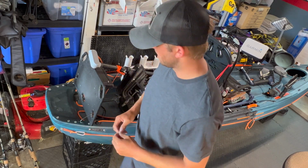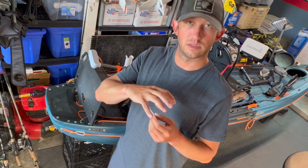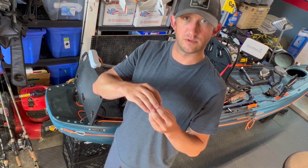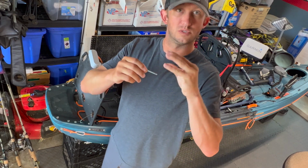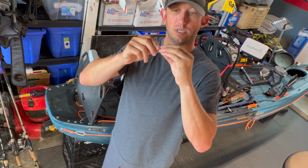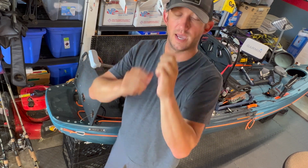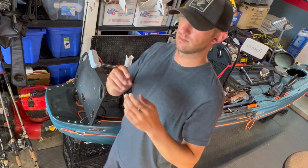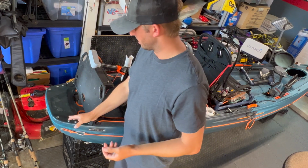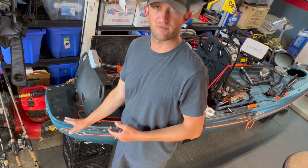So it works. But basically that well nut, like I said, has a nut on the bottom and these 4 legs that go up. And so those legs go up, and as you put it down into the threaded piece and then screw it in, those legs flare out, right? And they create a hold point. There's 4 of them. They probably create about the equivalent of a 3/4 inch washer inside of whatever you're drilling into.